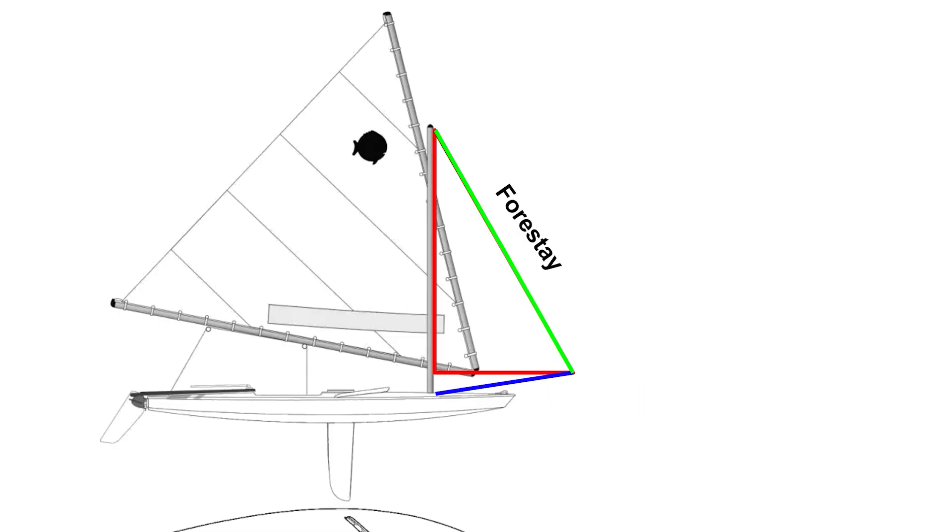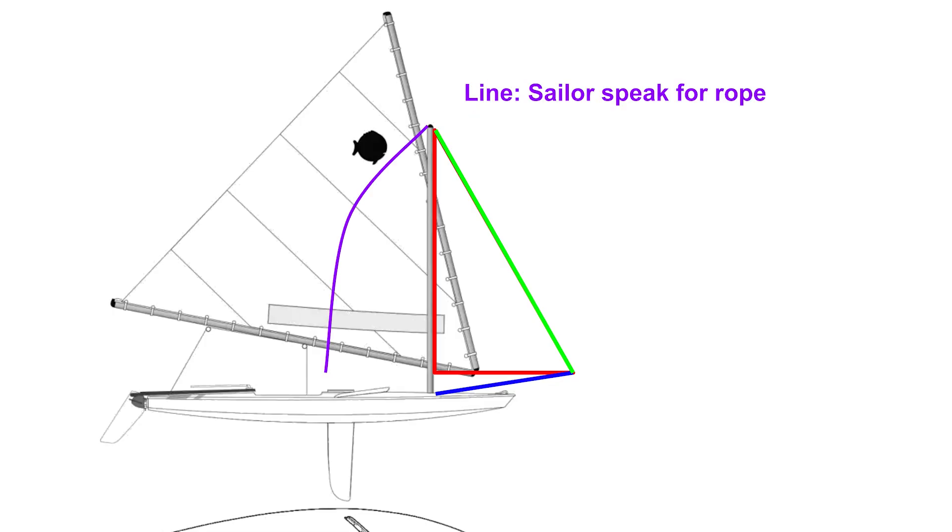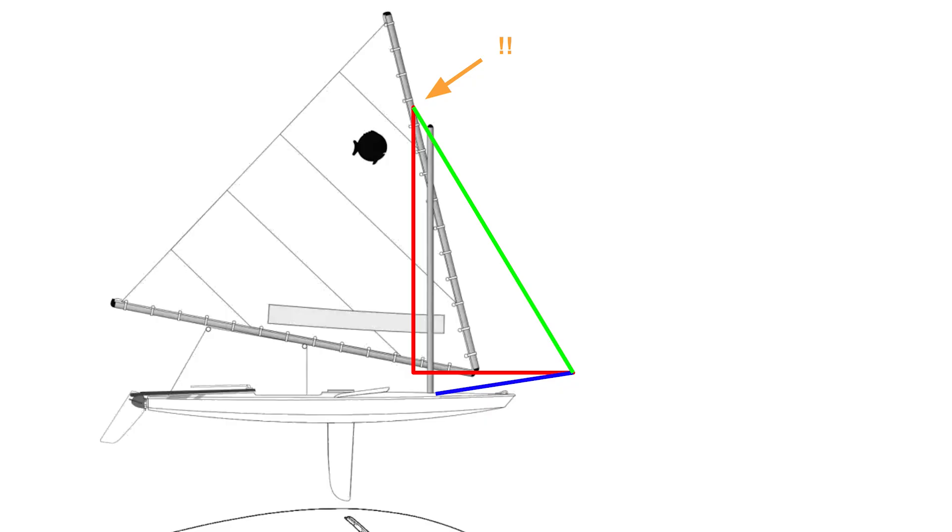In order to hold the front of the sail, we will run a rope through the front edge of the sail — this is called the forestay. The next question is how we will raise the sail. Sailboats have lines called halyards which are used to raise sails. But since the Sunfish is not supposed to have a jib sail, there's no jib halyard. However, the mainsail does have a halyard, so we had the genius idea of using the mainsail halyard to raise both sails at once.